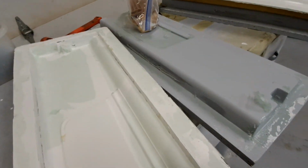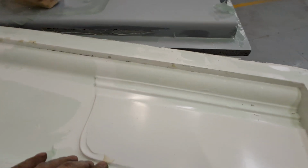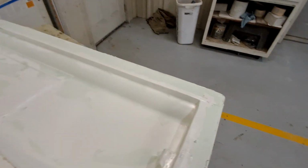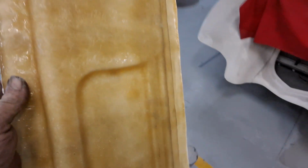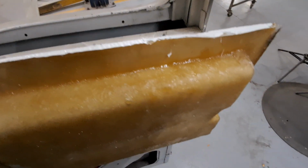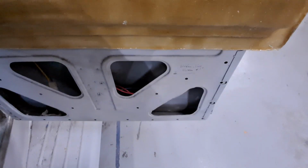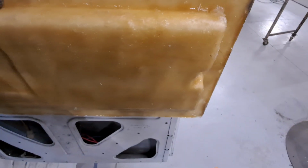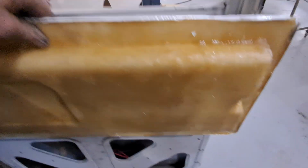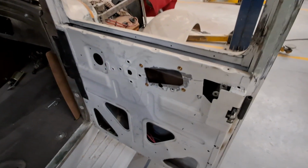Maybe I can give a visual here. This is for the door latches. This is the bottom, the rounded part is the top. So the passenger door, I look back, is sitting open. This would be the one. Again, it won't go all the way up because that protrusion is what's cut out for that. So this will sit right underneath the garnish molding, and then your handle and your window switch will be right there, and then it'll be a slab to the bottom. It'll stay above the seats. The backrest will clear it. It'll hide the motor and add some dimension to the door. So I'm very happy with it.